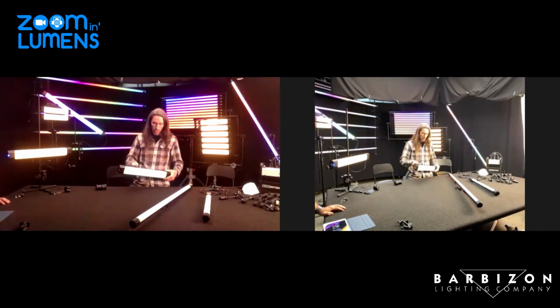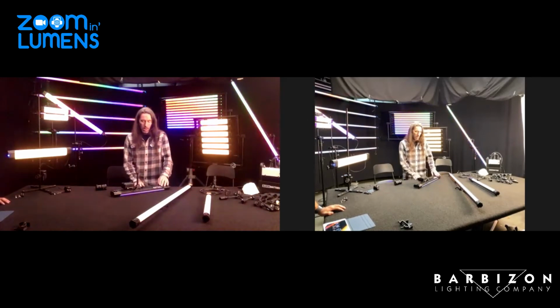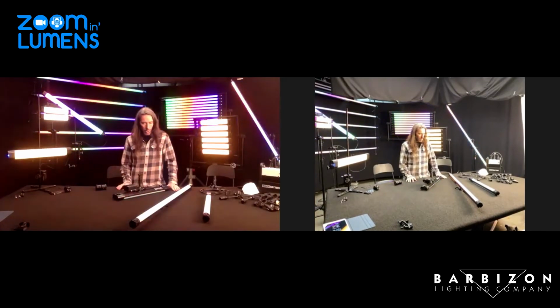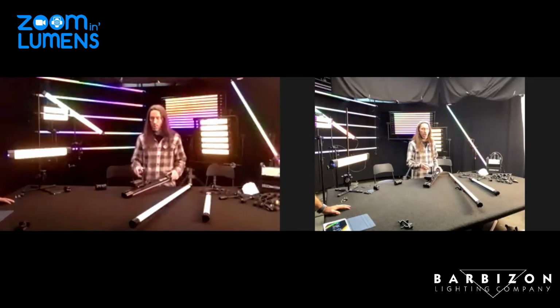Across the entire range, we try to keep really good TLCI and CRI, which I think we score 95 plus on. But the metric we really like to use is a newer metric that a lot of people are using called SSI. You might want to look it up and do some research on SSI. What SSI does is give you a more true comparison to your target spectrum. The number you get is how close you are to the actual spectrum, so it's a much more accurate number comparing your device's color to the true spectrum you're trying to match.